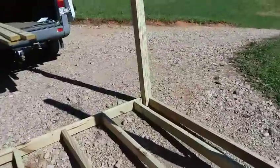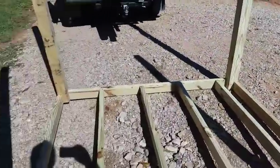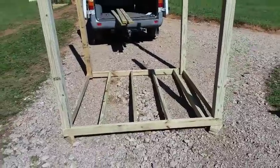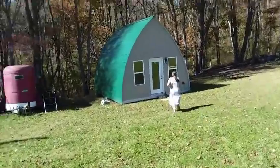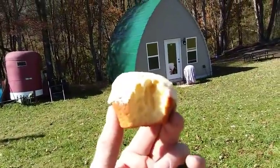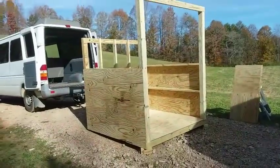I'm just making a real basic six by six frame — something any high schooler could do, 16 on center. I notched out those four by fours to tie in the corners, and then I'm going to overlay it with half-inch pressure-treated plywood. That was my cupcake delivery girl. It's important to have a cupcake delivery girl when you're on the job site, because you could grow faint from lack of cupcakes.